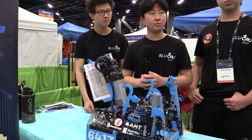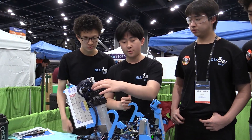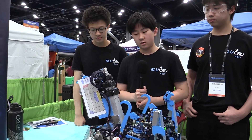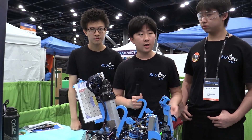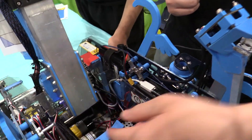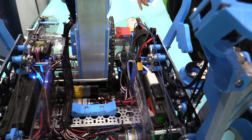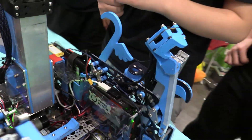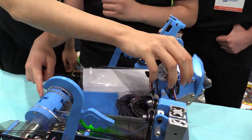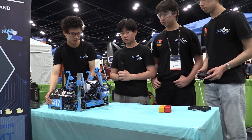These are printed out of polycarbonate and the blue parts are printed out of PLA. We only use polycarb for the main bearing blocks and spacers; everything else is PLA. We'd feel safer using SLS or aluminum because we've had issues with parts snapping. We're running two motors at 1150 RPM, geared together at 1.5:1 through a gearbox, then back down through a belt system at 0.66:1, resulting in a net 1:1 at 1150 RPM. The pulley system uses 14mm diameter for extension and 42mm for retraction — it's a cascade extension.